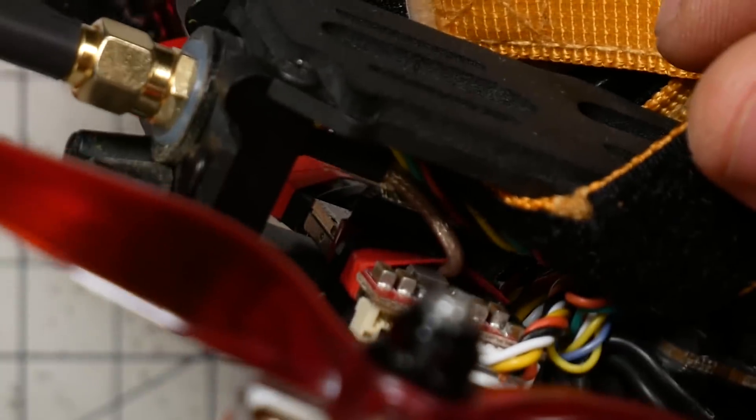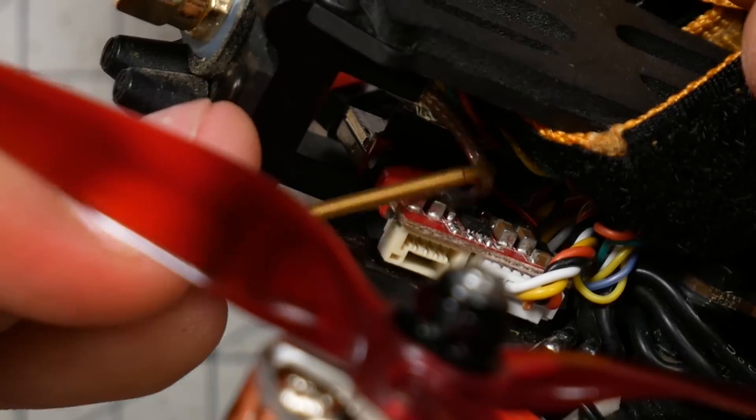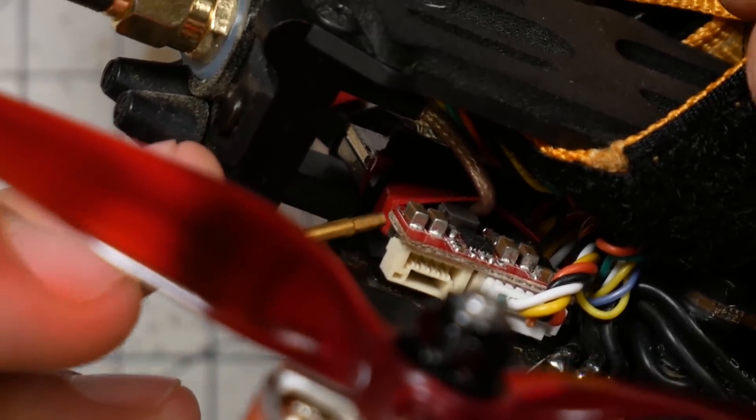You can see I'm also using electrical tape right here to restrain the pigtail on my video transmitter — just cut a little strip of that and wrap it around there. I like that it stretches and compresses gently and sticks to itself. That's kind of how I use electrical tape on these builds. And if you're in the field and you smash your balance plug on your battery and the wires are all hanging loose trying to start a fire, wrap them in electrical tape. It's perfectly good for that. For field repairs I will use this for electrical isolation, because I don't usually bring a whole big heat shrink assortment to the field.